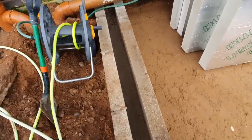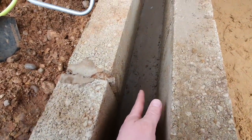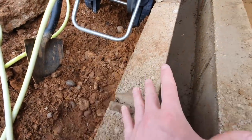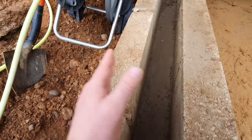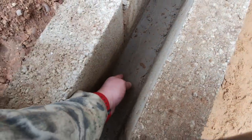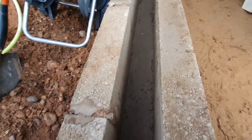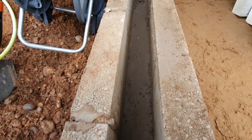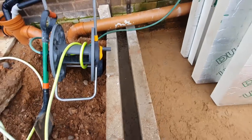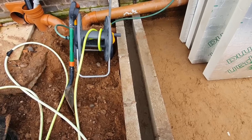We've also filled the bottom of the cavities. This stuff here is what they call cavity fill down the bottom, and this supports the wall between the bottom of the concrete floor and the outside of the building, so that these two cavities don't get crushed together over time with the loads coming from either side. This is just a weak mix - about five or six to one - of ballast, two sharp sand and one cement. The foundations themselves are a three to one mix of building sand and cement, so they're solid.